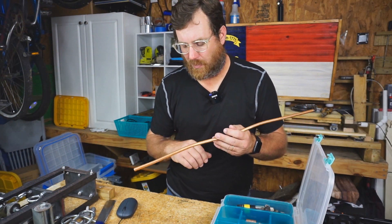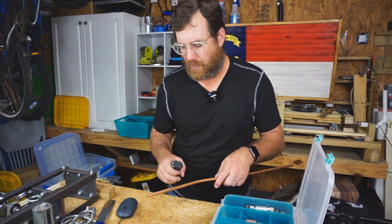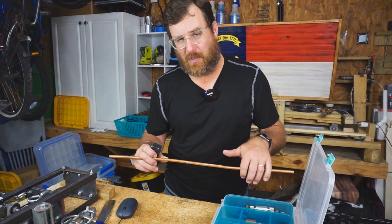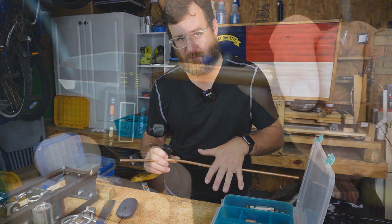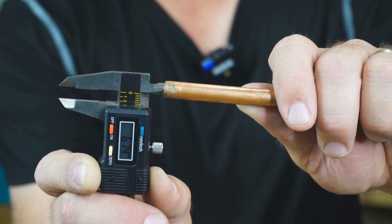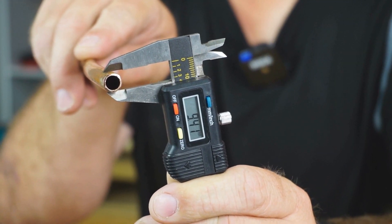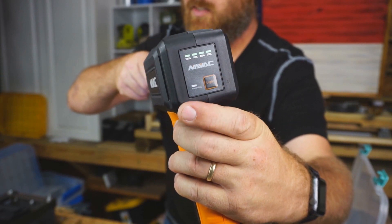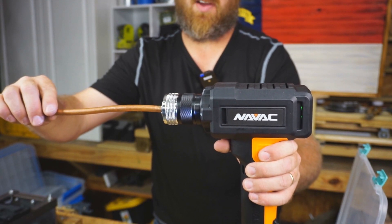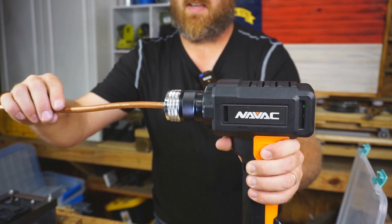I have a piece of 3/8 copper. I'm going to use our copper cutter to ream it out and clean it a little bit and get it ready for expansion. Then we're going to see how long it takes to expand the copper and how the copper fits together once the expansion is done. The interior diameter of this copper after I reamed it out is 6.74 millimeters, and the outside diameter is 9.41 millimeters. The battery is fully charged. It's supposed to take about 12 seconds — that's what they said on the box — and that could be for the smallest fitting, which is what this is.